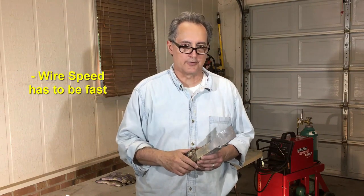I used 100% argon gas. You can't really MIG weld aluminum with 75-25. That's 75% argon, 25% CO2. That's a standard MIG welding gas you use. So 100% argon for aluminum wire. The other thing is you've got to weld fast.